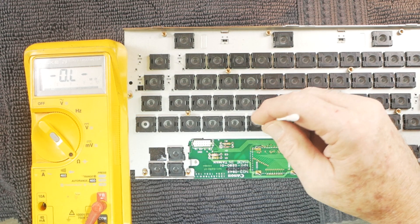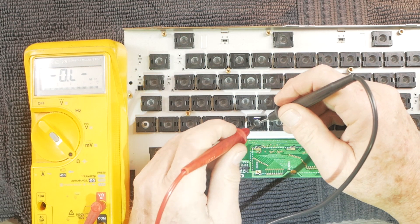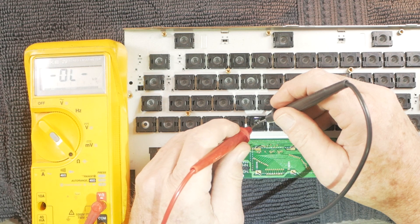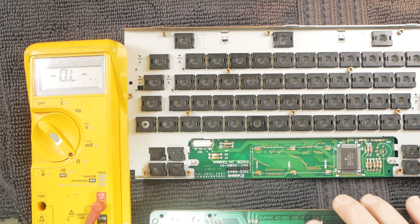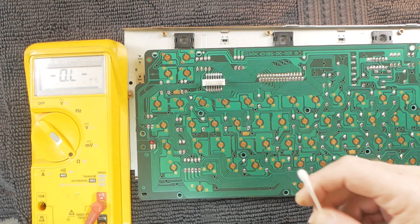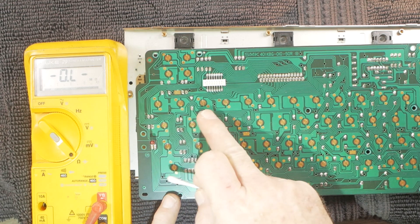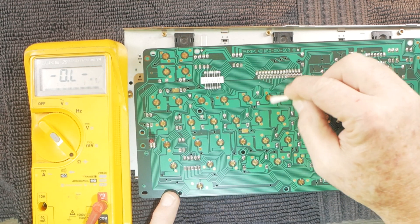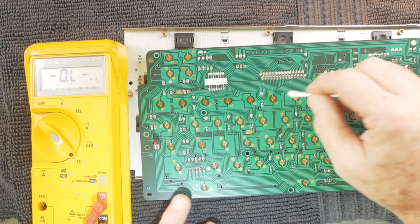I'm going to dry it with the other side of my Q-tip and then check for continuity again on that little pad to make sure it's conductive — and it's conductive. But that's not all. I'm going to take the circuit board and also clean those bare foil traces. The sixth one over from the left is this one — it looks clean. But while you're at it, you might want to just hit them all.